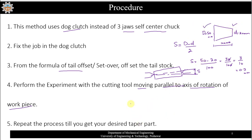Remember that during the experiment, you apply a certain depth of cut for each complete cycle. After each pass, measure the diameter using the Vernier caliper, and based on the difference needed, apply another depth of cut. Continue this process until you achieve your desired dimension at both ends.